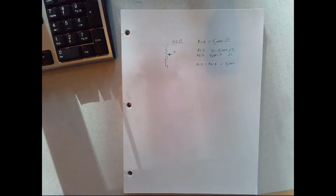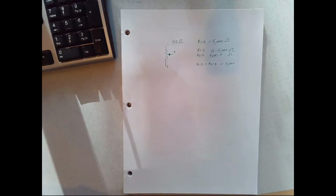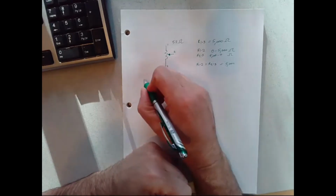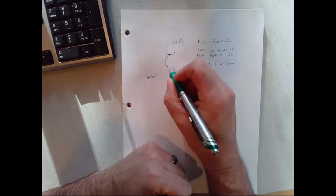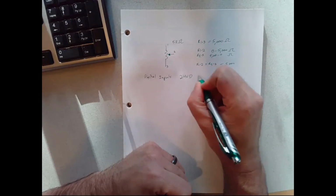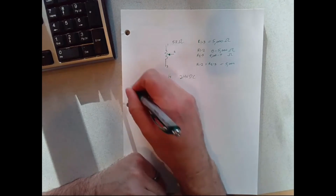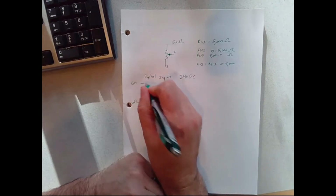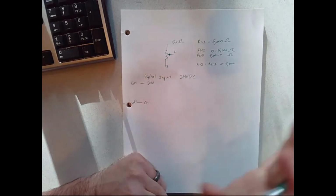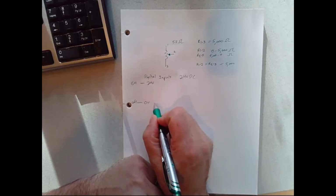We're going to use the potentiometer, and we're going to set up our card to be looking at an analog voltage. So far we've been dealing with digital inputs and outputs. Digital inputs on our PLC are 24 volt DC. So their input can be either off or on. Basically that value is either 0 volts or 24 volts nominal. We would say an off is 0 volts and an on is 24 volts.